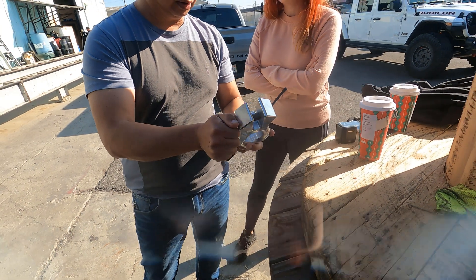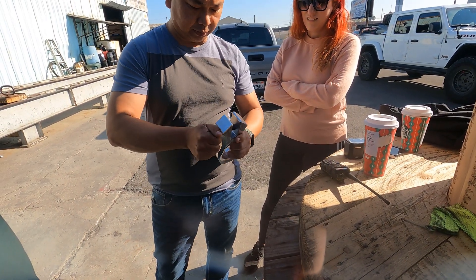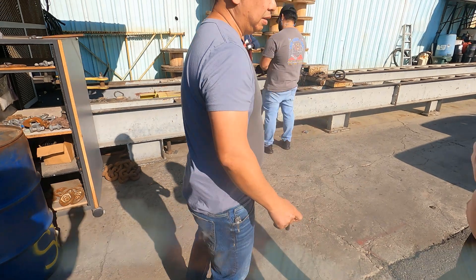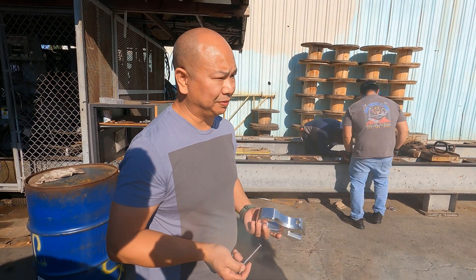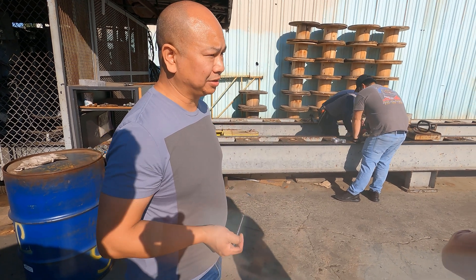It's a 5/8-inch pin — can you make that one fit into that? No, that's a half inch. I should have gone 5/8 on that one. If this breaks at 60,000 pounds, we know that 40,000 is easy. It was the pin that broke, the shackle body is fine.